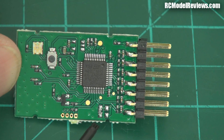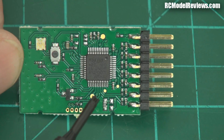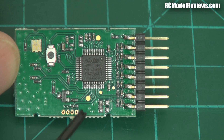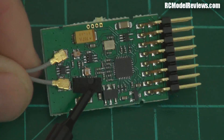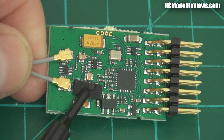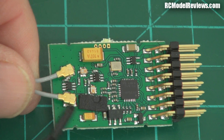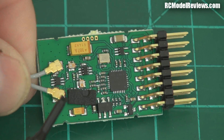There's a little switch, a couple of LEDs, another little regulator or something down here. There are little resistors in series with the servo output so that if you short them it won't explode, and when you put the bind tag on it, it doesn't draw too much current from the processor. It's all pretty standard fare. Construction looks pretty good. The boards are perforated — they populate all the boards as a big sheet, reflow them, then break them apart before putting them in the case. Soldering seems okay, no problems.